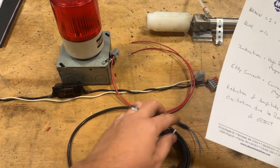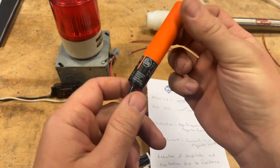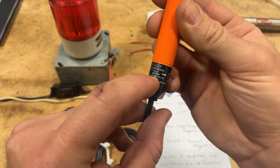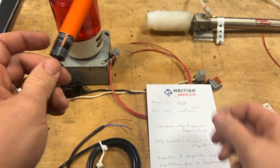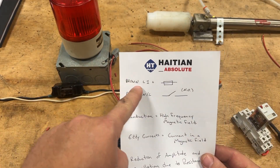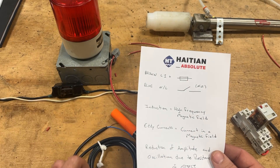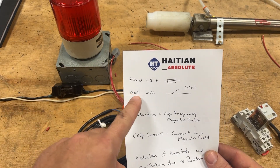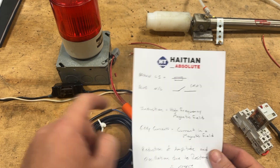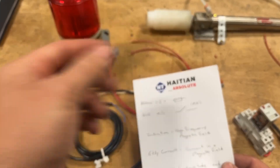On this particular switch, it's a two-wire AC switch. Here on the label, just like a motor, it'll tell you what the operating voltage is. This particular one is 20 to 250 volts AC or DC — this thing's super valuable, you can use it in a ton of different circumstances. So we know the brown wire is the positive, or line one, that takes a fused input. The blue wire would be your neutral line, and that's what activates your normally open switch.